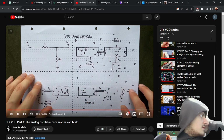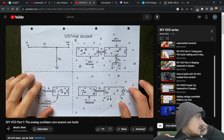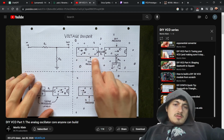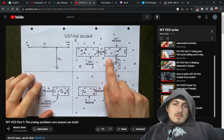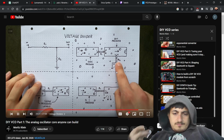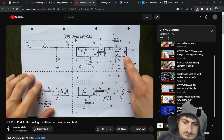Nice. The output voltage will be half of what the input voltage is. How does it work? Let's use our analogy again. So we have a pipe on this side, where water is being pushed in this direction with a specific amount of force. Attached here is a narrow pipe, which represents R1, followed by another wide pipe. Then down here, there's this other narrow pipe, representing R2, where water can exit the pipe system. Finally, imagine we have a pressure sensor attached right here.